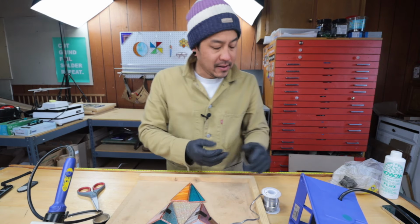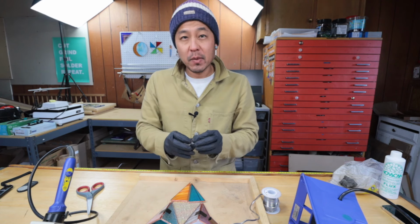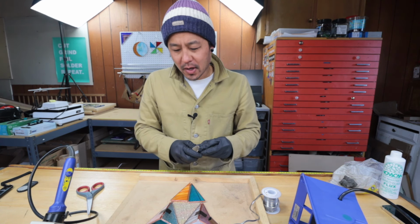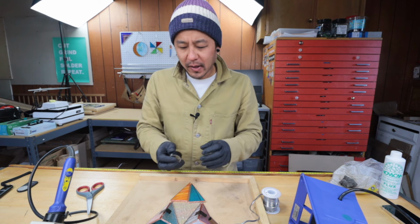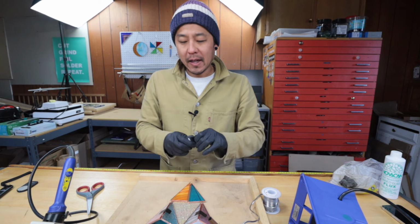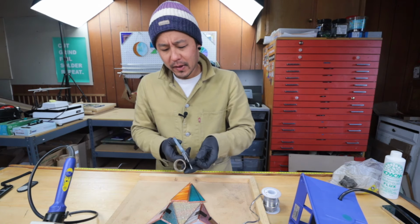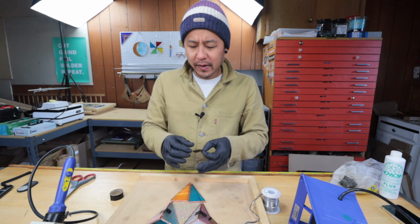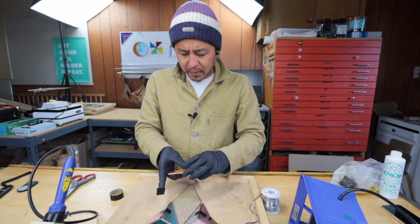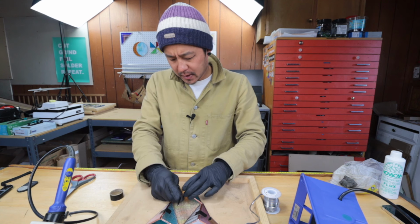Yeah, see, I take a lot of time looking at this, trying to predict what the outcome's gonna be, and if the solder, once you cover everything up, is it gonna be okay? If it's already off, like alignment wise, sometimes you can't fix it. You can't really cover it up with solder anymore. You'll see it and it'll show. And so you have to pay attention to that. But I'm looking at this and I think we're okay with this piece, all of it here.